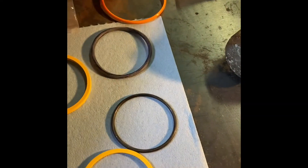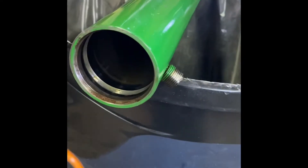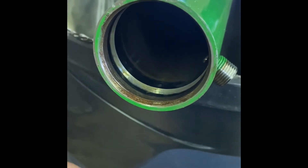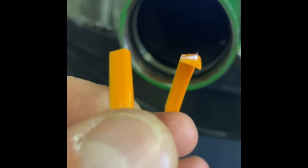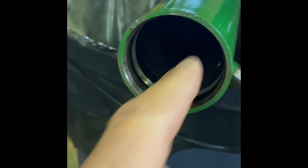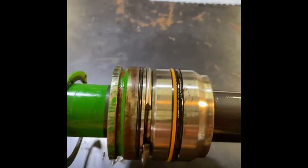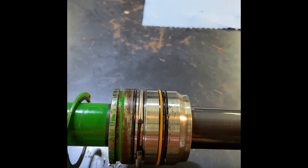This is the tool that you have to put inside this part to get the whole thing out. That goes in that groove - you can see a little groove right there. This is tapered, so that tapered side on the left would go toward the inside of that sleeve, and that allows this expansion ring to slide past that groove and come out.